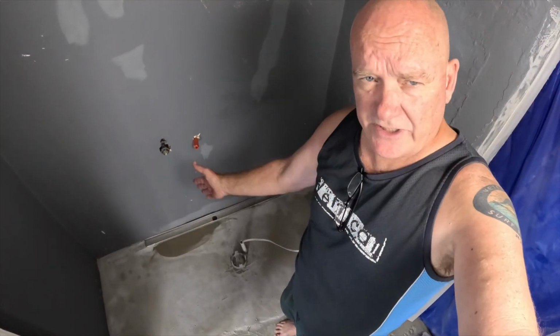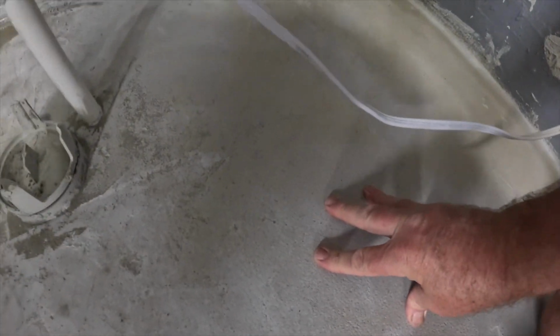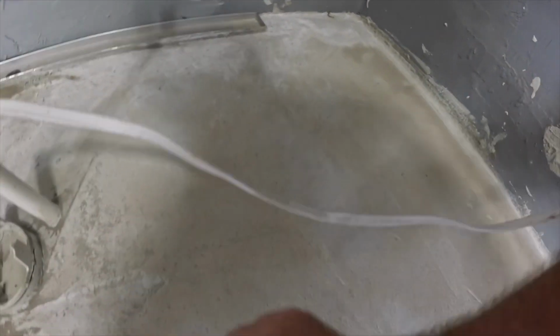That last layer of screed has been down for 2, 2.5 days now. It's hard on the surface, but in a lot of places there's a hollow knock. That's hollow-ish over here. Solid. Not a lot of difference, and I'm not worried about it because A, it's very thin, and B, the weight distribution across big tiles is such that there'll be no movement anyway.